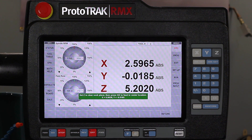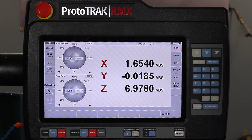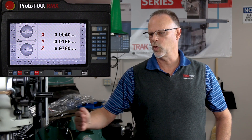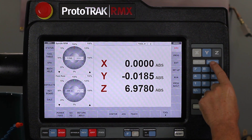You'll see that it'll process what I did. It'll tell me where it has to go to find the middle between those two points. Get the quill out of the way. Push go. Automatically shuts off the spindle at the end. So I would do that for each direction. That'll find the middle of my piece part and then all I have to do if I'm not on zero is to reset my zero.